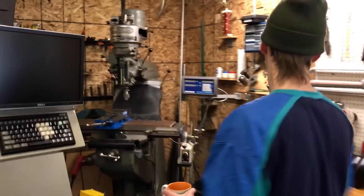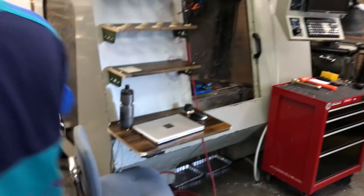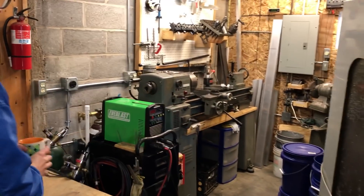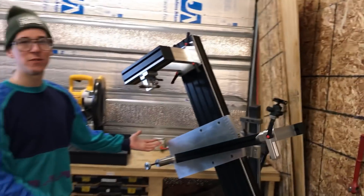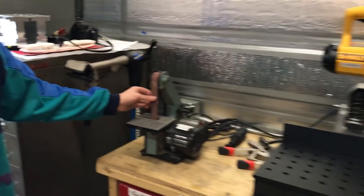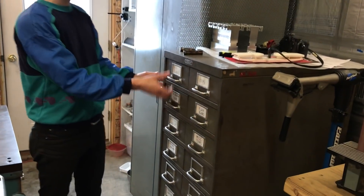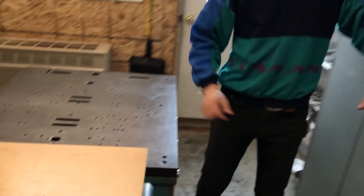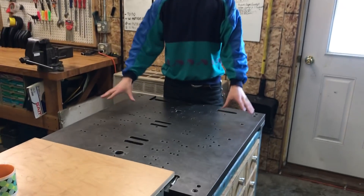I've got a Bridgeport manual milling machine, my bench with a heavy vise, hacksaws, hand files, and my CNC milling machine from 1996. I've got a manual lathe, a pedestal grinder, a DC TIG welder, and my oxy-acetylene torch rig. This is my shop-made frame building fixture, my chop saw, a one-inch belt sander really useful for tube prep, my Steel Age brand cabinet with drawers for tube storage, and a 32 by 36-inch steel table with a Blanchard ground top you can use for alignment.